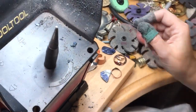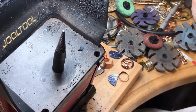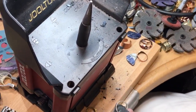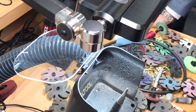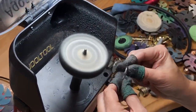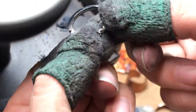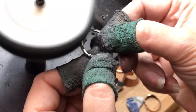You might get questions about the inside — yes, the inside you can do with our inside ring polishers. Let me just finish the polish on the outside. As soon as I find my pick-a-buff... I don't want to use one that has no compound. This is for polymer cream — I'm not even putting compound on, and I just want to show you the luster that you get. We're not relying on compound right now to get the high polish. The high polish is there. I'm just using it for added luster and to remove the fine lines from the felt.